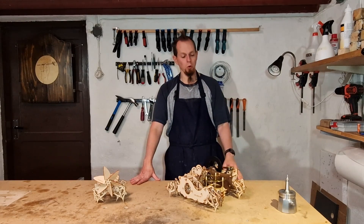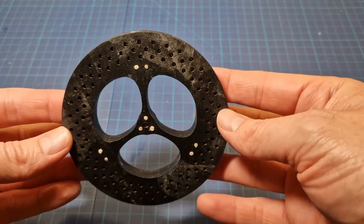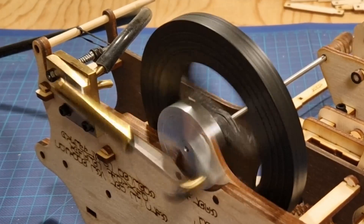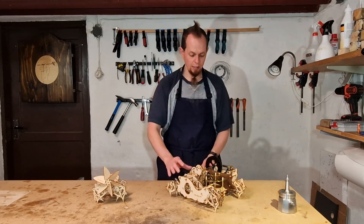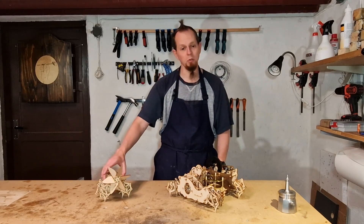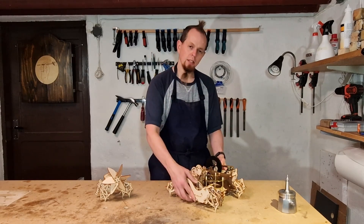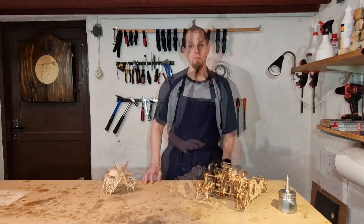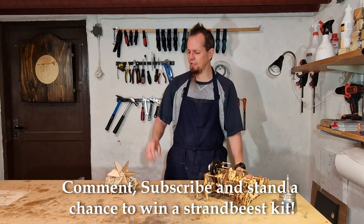All in all I'm quite happy - I'm impressed that it walks, kind of almost on the first try. The new flywheel is brilliant. It's really heavy, three times as heavy as the previous one, so that works really well. The engine is really well optimized now. The optimizations for the next step are the gears and the legs, but mostly the legs. For this small model it's really easy to get it to run because it's really light, but as soon as there's weight on it the problems start to occur. If it is held up while it's running then there's almost no problems. If you're interested in winning one of these kits, just leave a comment and subscribe and I will contact the person with the most upvoted comment and send the kit to you.